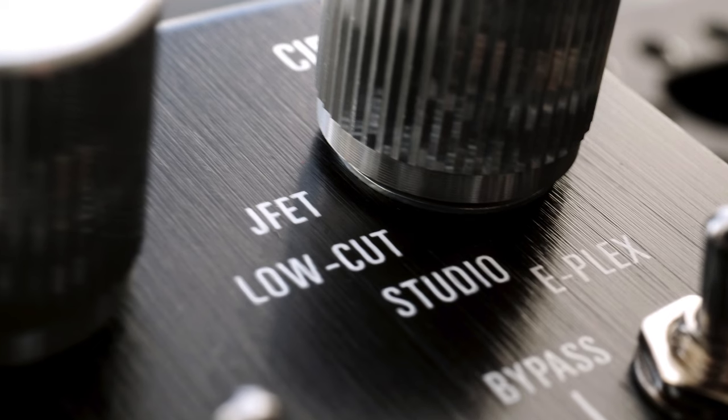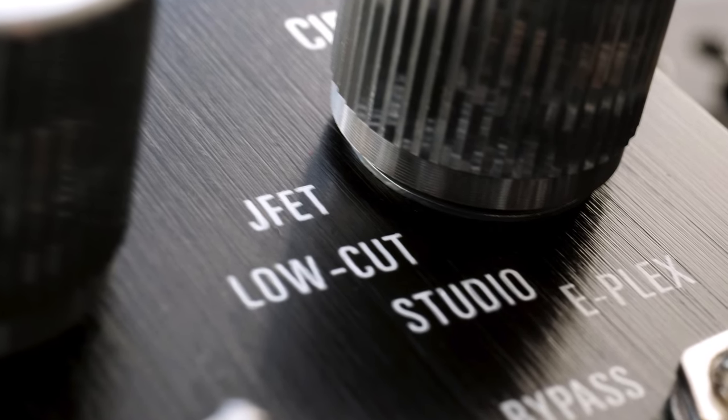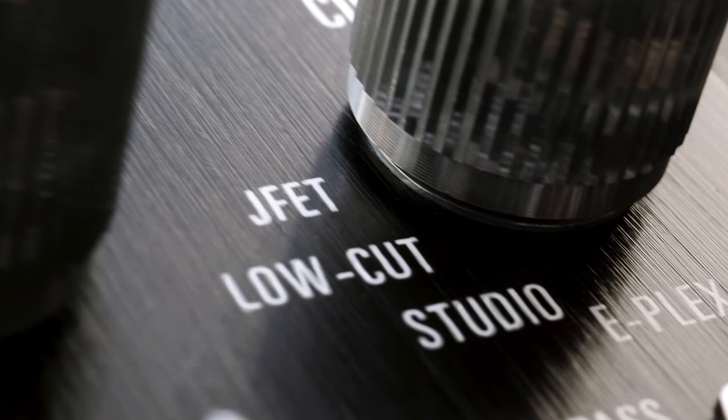When talking about the ideal microphone preamp, a lot of people use the term wire with gain. And what that means is, basically, it's the same as just plugging in a microphone directly and you don't lose or gain anything. And that's similar to the philosophy behind the JFET mode on the ZIO. JFET mode in this case is more like a guitar cable with gain, and it has very low noise and very low distortion. So we're talking something around 0.003% of distortion, which is extremely clean. This basically is meant to maintain your sound, but just make it louder.